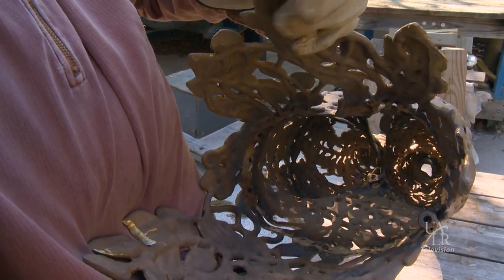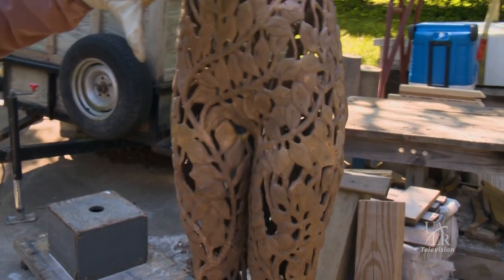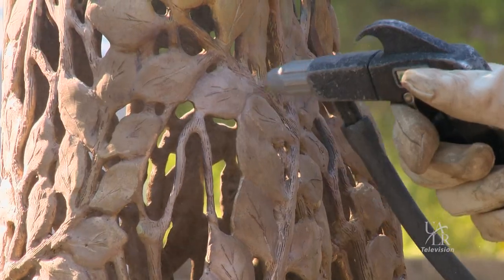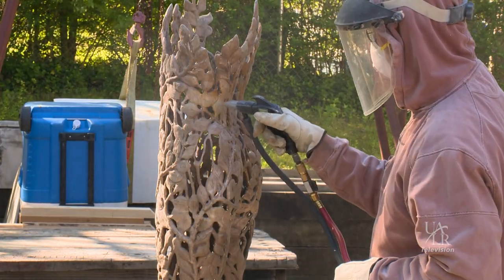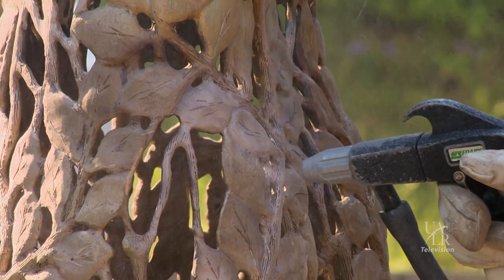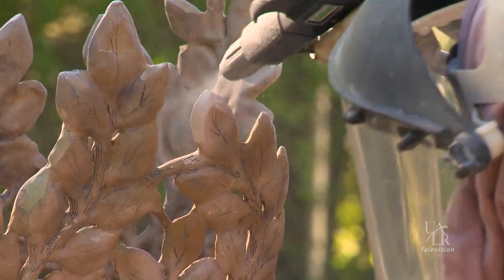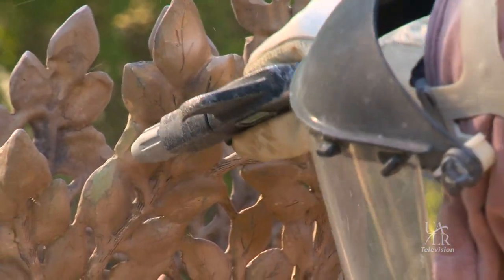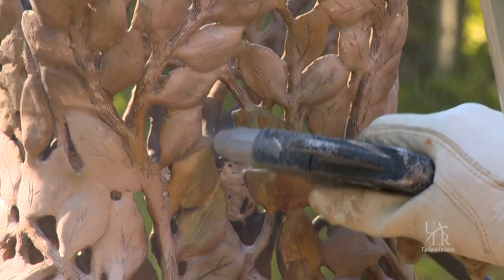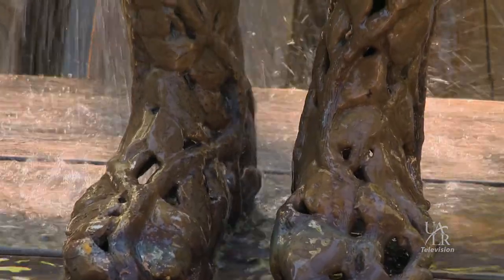That's where the little bird sits. This is where we welded the parts together, from the inside. You can hardly tell where they're joined together — the idea was to make it more fluid so you can't see where the parts were. Part of the reason we sandblast is for a final cleaning before putting any patina on it. On some of these little leaves there's a shiny surface where I've sanded, but I want a more uniform, subtle texture, and it'll clean it all. I'll do a final cleaning with the sandblast, rinse it, and then spray a black patina on it.